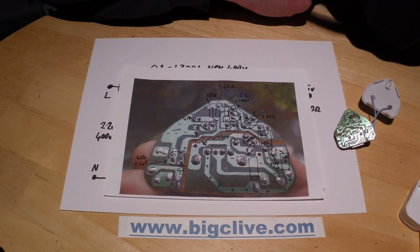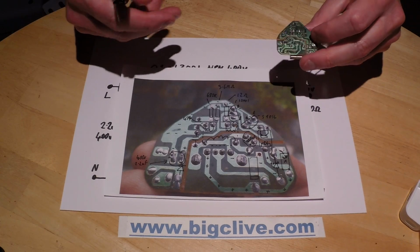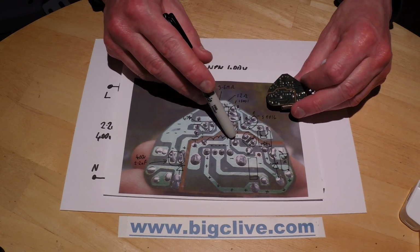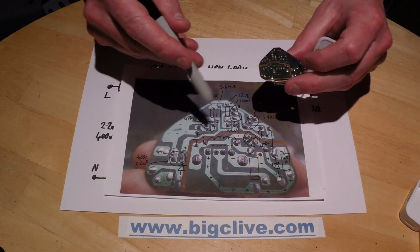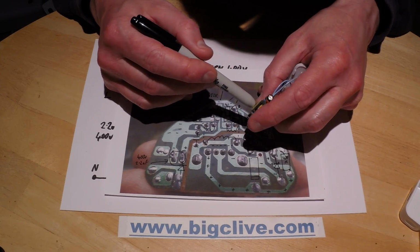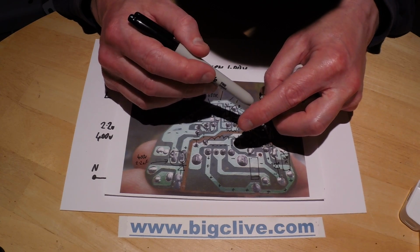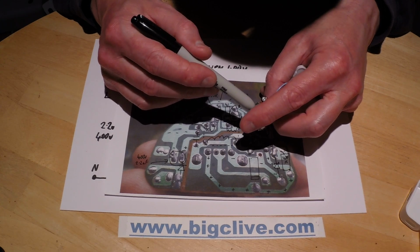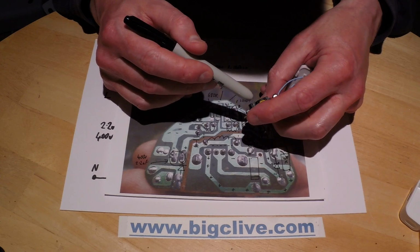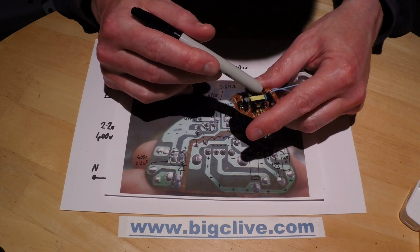It makes you think of that instance in Japan where the air hostess was electrocuted by her phone. And that's the sort of thing that, you know, it could have been moisture getting into it, it could have just been tracking across, it could have been a solder splash, or it could have been the isolation of these transformers, because I'm not 100% sure how good that is. Looking at it at the moment, it looks as though the secondary is wound possibly on the outside. I'm not 100% sure without stripping that transformer to bits.